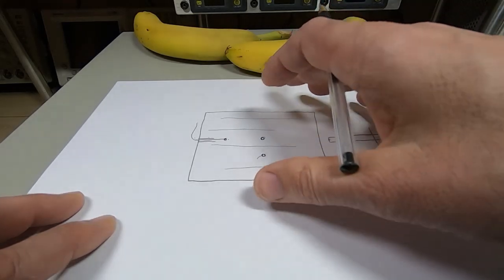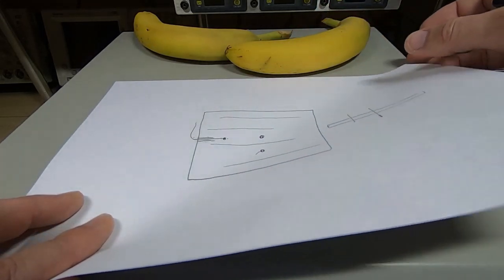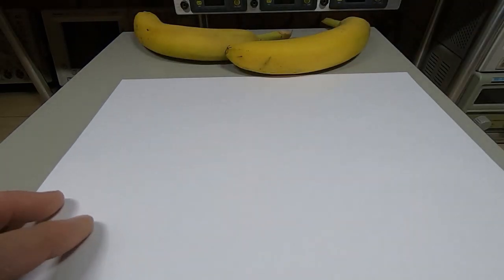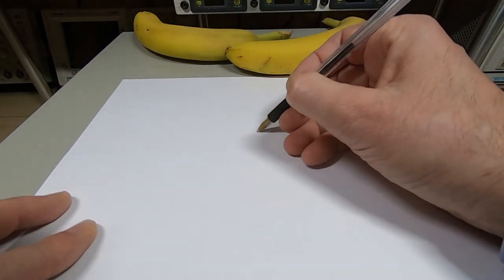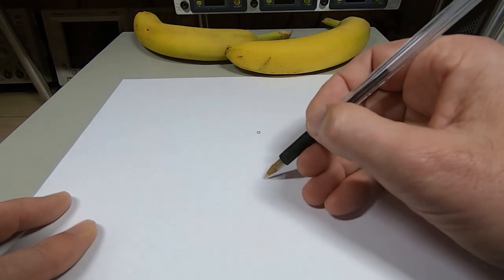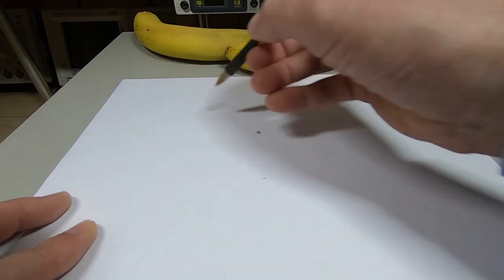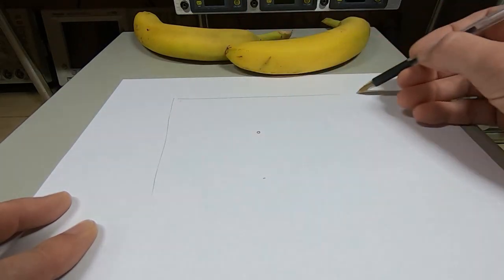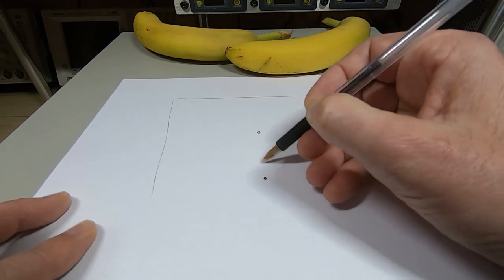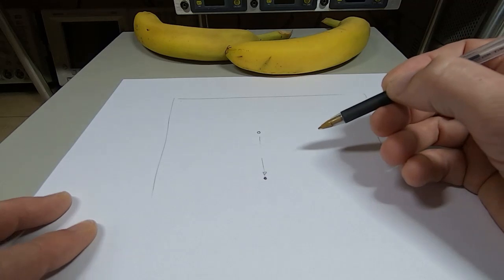So I wanted to move the air around inside the chamber, and this is where I got the biggest gain when I was making the modifications. So what I did is I fitted a fan. Now you're limited on the size of the fan that you can fit, of course, because you do have this sensor. If I redraw the chamber, that's the center. Of course, we've got the chamber out here, and we have this forward sensor, so that's the maximum radius you can have for the fan.